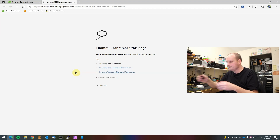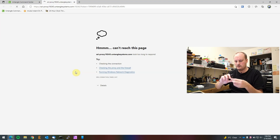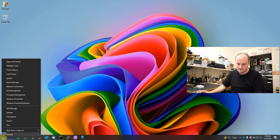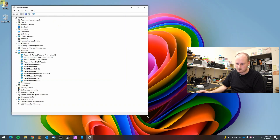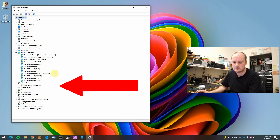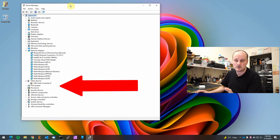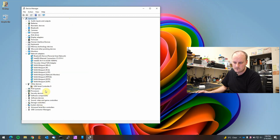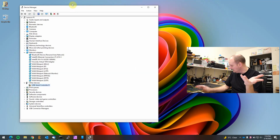One last thing — let's try that micro USB cable. I don't want to lose any cables since I have to give this back. Let's plug it into the laptop and see if an RS-232 port shows up. Going to Device Manager, under network adapters... I just heard it detect — there it is: USB Serial Controller. I knew that's what it was for, since there's no video ports. There's probably a procedure to update firmware or restore the box using it.